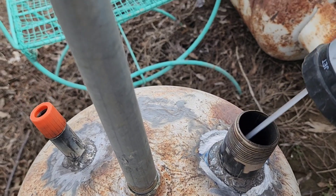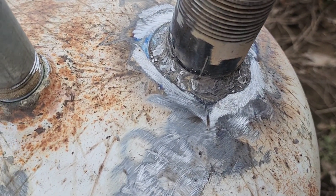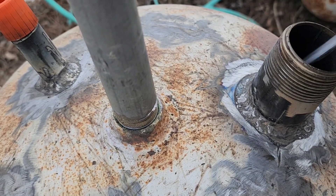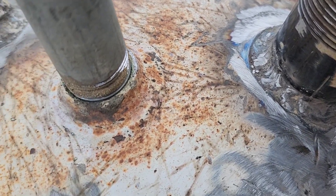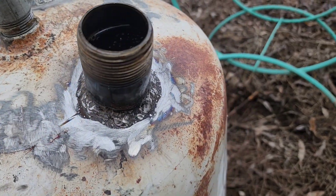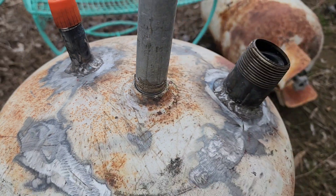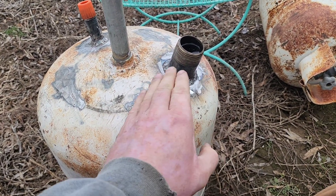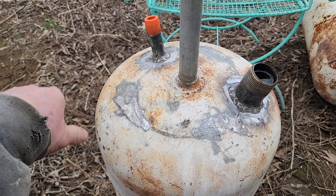I added the pipe to the middle just to get the fill height higher. I'm going to go ahead and fill this with water and see if any of my welds are seeping. This also gives me a chance to rinse it out a few times - swish it around and dump it out - so any sanding and cutting debris that went inside can be cleaned out. So far so good, I don't see any obvious leaking. And to be honest, this fuel tank is never really going to be filled that high, so it's just going to get little splashes up around my welds. Remember, this is a tube all the way down, so my weld doesn't affect its suction.